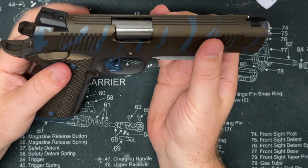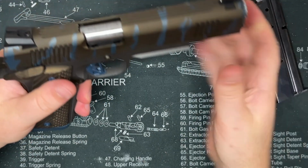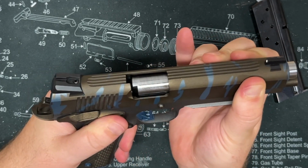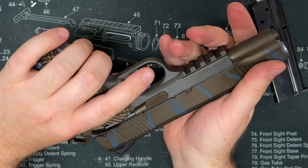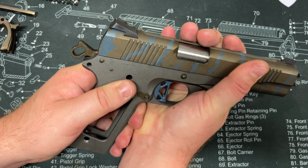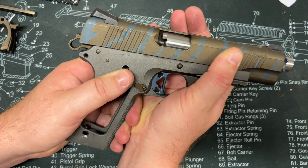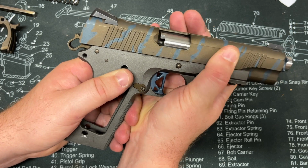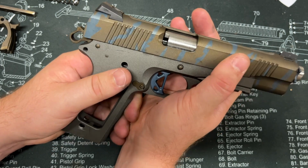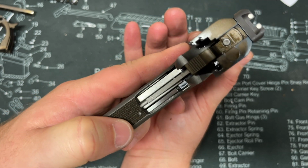And that's when basically I took all the springs out and I would just sit, I would get the hammer out of the way, I would sit here without springs in it and just feel for where I had ever so slightly more friction than elsewhere. Okay, so we've got no recoil spring in, the hammer is cocked, and let's look at this. Okay, it comes out of lockup very, very softly, very easy. There's a little bit of something right there that I can feel, but not a ton. And then it goes back very smoothly until it hits the hammer on that retaining plate back there.